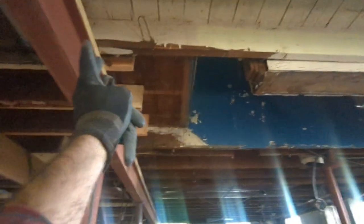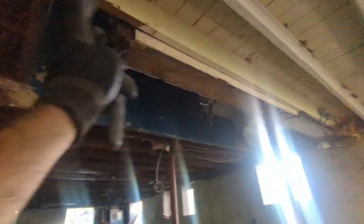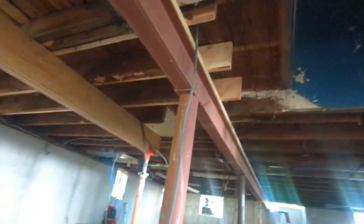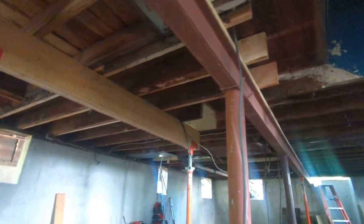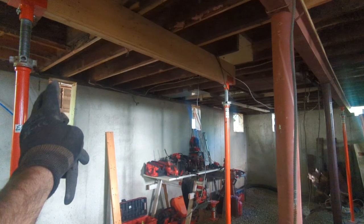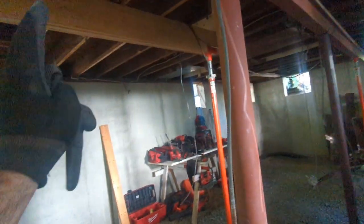The engineer and the architect want me to have a beam under this old edge of the house all the way over there, which is where we're going to put a couple layers of glue lam on that joist. But going that way, it's the same situation. And we don't have any pier or any post or anything. It's just doing that span over there. And it's a shorter span here than here, but it's not going to hurt anything, so we made it beefier.